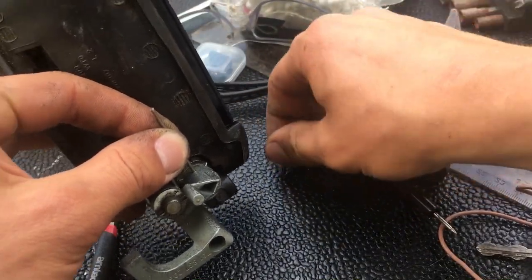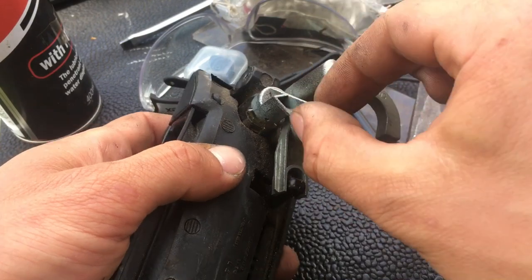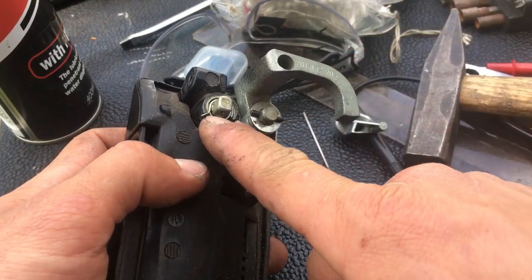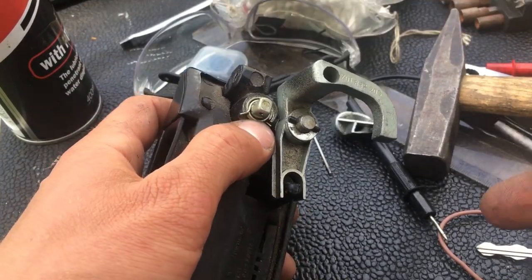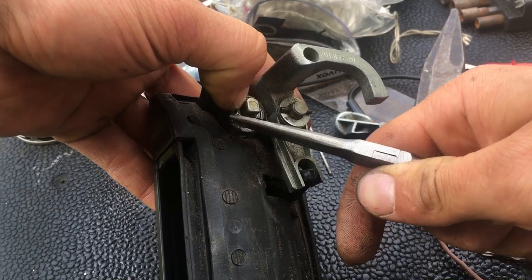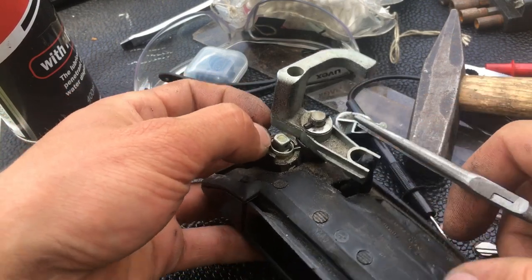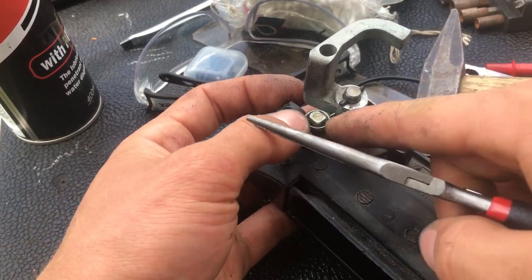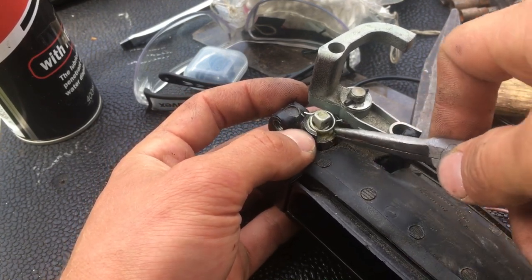That's the pin — make sure you don't lose it. As we take this off, this just comes out. That's the fitting, so you know which way it goes back in. There's a spring here, so be careful when you take it off so it doesn't jump out and get lost. Remember how it went on, as there's quite a lot of tension and it can be a pain to put it back in. When you put it back in, fix one end and then tension the other — I'll show you when putting it all back together.